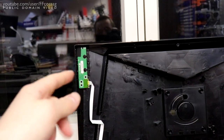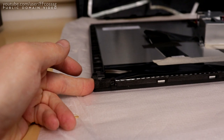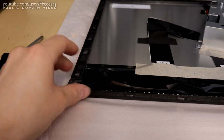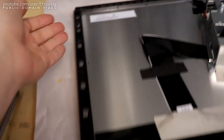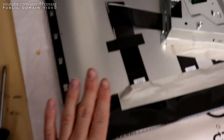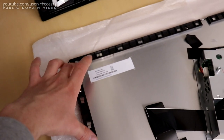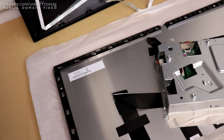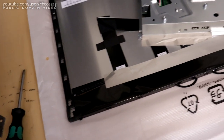And the worst panel backlight bleed was down by the corner of the power buttons, and that's where we have this foamy bit. So there we go. That answers that mystery. The most common cause for backlight bleed is just for the panel to be ever so slightly bent. Most of the backlight bleed was in that corner, some in this corner. And if I actually took and physically put some force on the panel and bent it, it would change the nature of backlight bleed. So perhaps we'll have a decent chance of improving that a bit while we're in here.